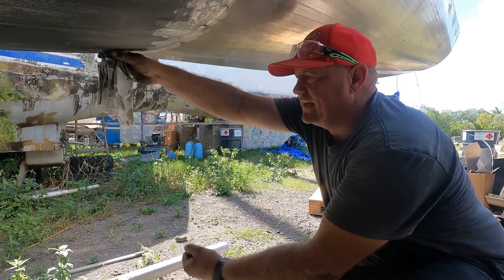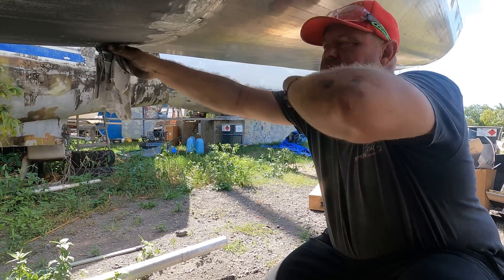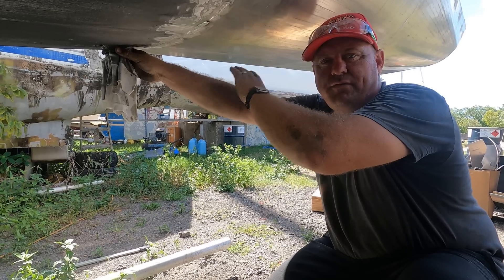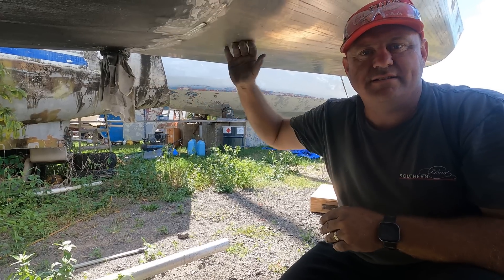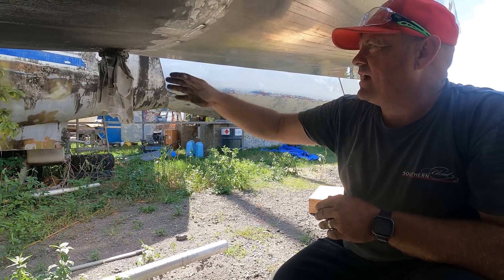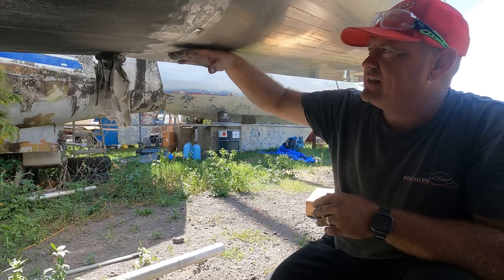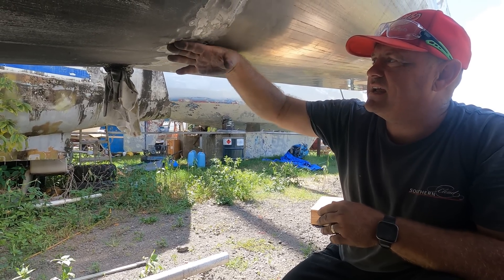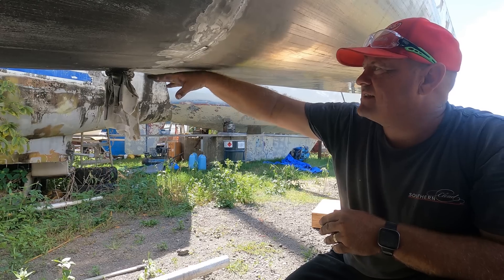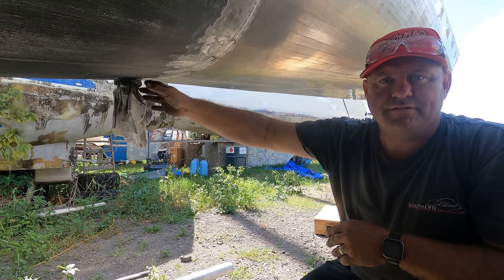I don't actually know how much clearance is in there, and we can't put the rudders in until we're raised up and on the trailer. So we'll just do a little bit on the front and next refit we'll modify the backs of them to make them nice and close with very little clearance when they're in the middle. What we will do is smooth off this transition - there's a slight little kick there so we'll just bog in the centre here and make a slightly smoother transition so it can flow through to the end.